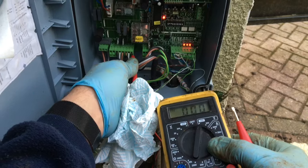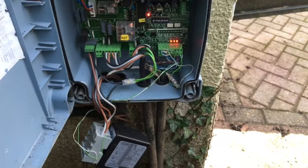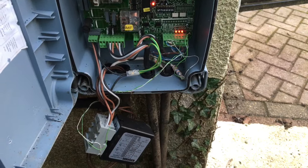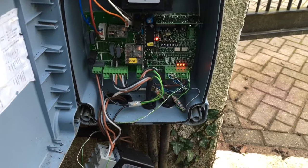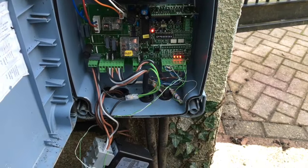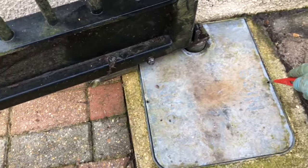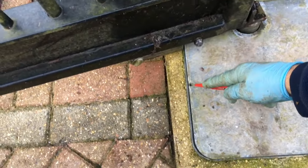In my particular case I was having voltages appearing but the motors were making no sound and weren't moving at all. So I had to move on to taking the covers off the motors and investigating. To get to the motors there are two little screws here and here that need to be removed.